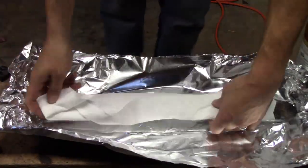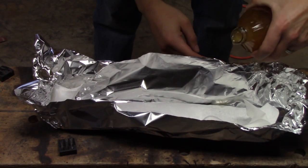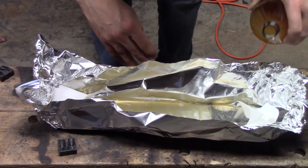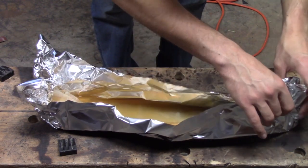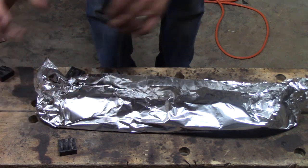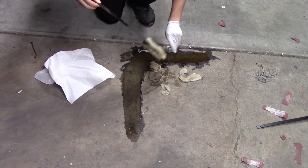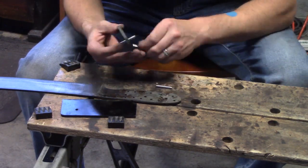Here's a gator belt which is around 400 grit. I decided I was going to try to do a patina, so I'm using apple cider vinegar. The patina helps against rust, and when you're cutting certain foods like meats and certain fruits and vegetables that have acids in them, this will help so it doesn't discolor the blade. With stainless steel you don't have to worry about it, but with high carbon steels like this one it's a good idea. So I just let it sit for about 8 hours and it turns into a nice gray color. You can do multiple soaks if you want.